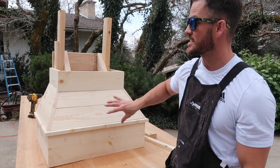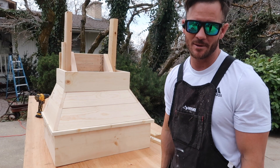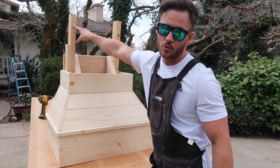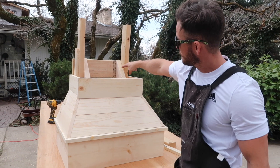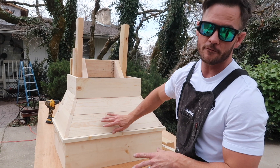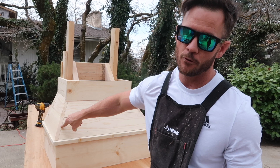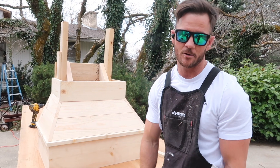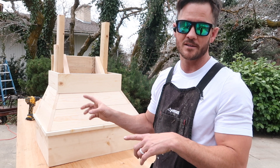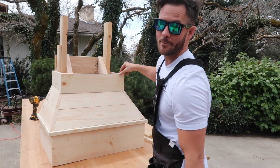I can link a tutorial on how to do a step-by-step build that you can follow if you have a similar design. Right now I have my framing on the inside — basically two vertical two-by-fours at the width I wanted — and then I did 45s coming down to two more framed-in two-by-fours. The front face is at a slant, allowing the sides to slant as well, so you'll have two angle cuts. Mine were 40 and 40 degrees by 15 degrees to make it flush and at an angle. If you're not comfortable doing angle cuts or figuring out dimensions, I highly suggest looking at that blog step-by-step tutorial.